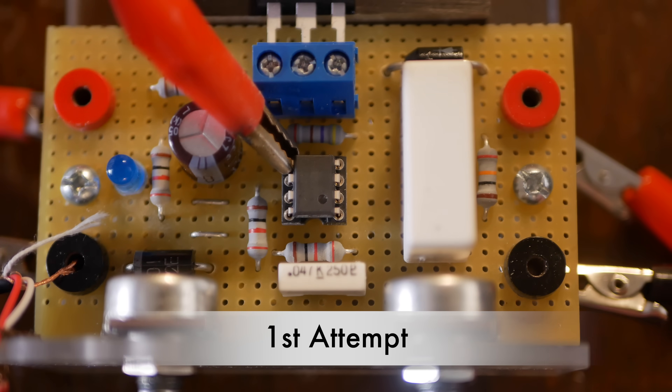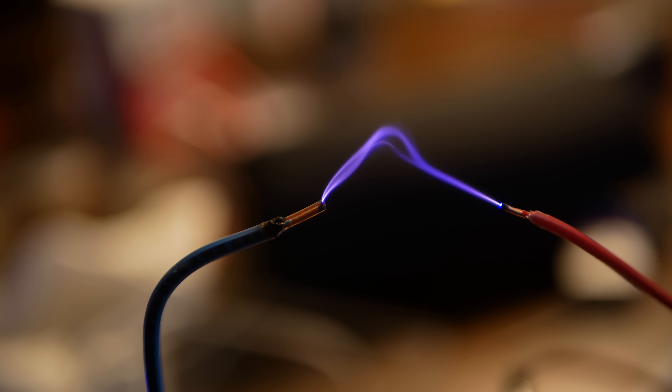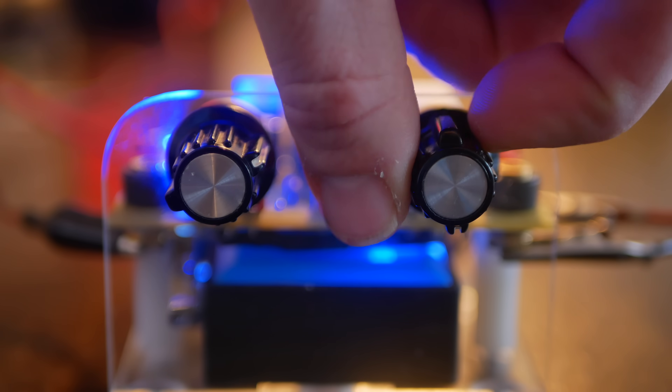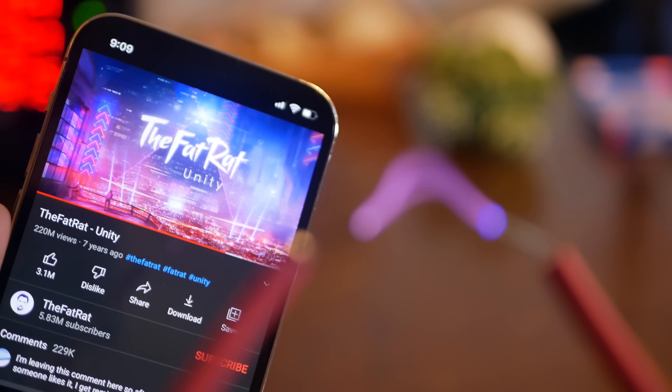The first attempt was exciting. I made a makeshift audio connection, synced the Bluetooth, fed it some crappy Mario. Results were rough. Could you hear the 8-bit Mario music hidden amongst the shriek of a thousand banshees? Hey, it was working. I swept the whole frequency range trying to get rid of that background pitch, and the music improved. I quickly realized that background pitch was there to stay, regardless of what master pitch you set the circuit to, but it did provide the highest audio quality at the higher frequencies - which makes sense because higher frequencies means more sparks per second, therefore finer audio detail.